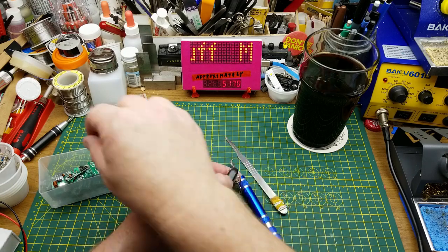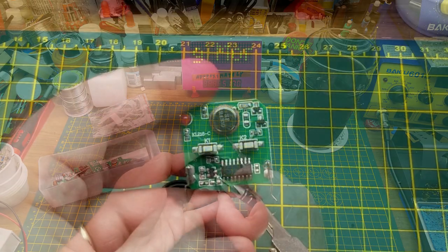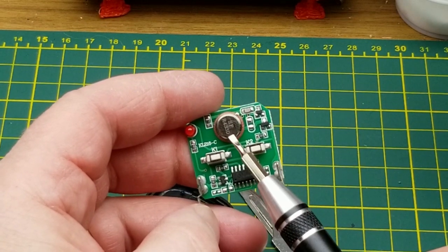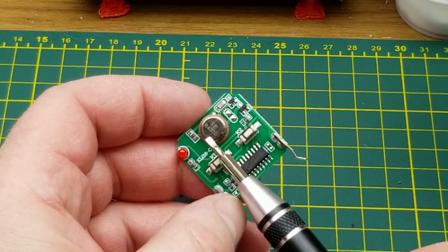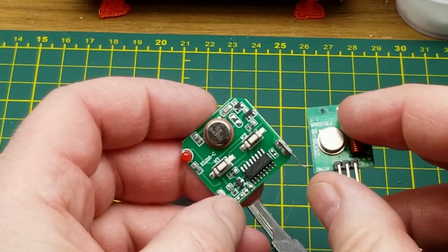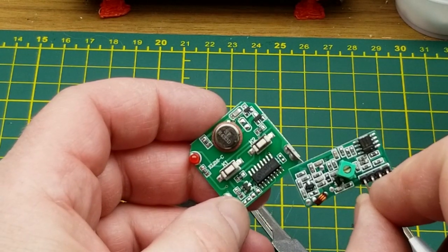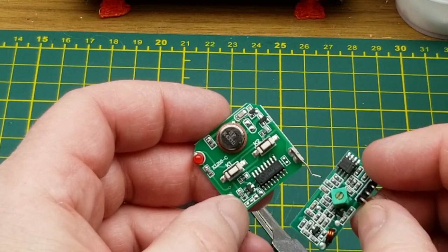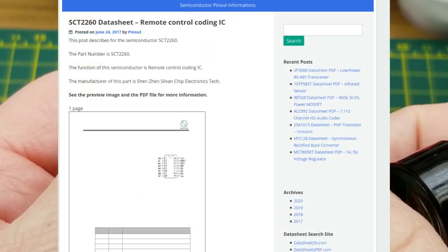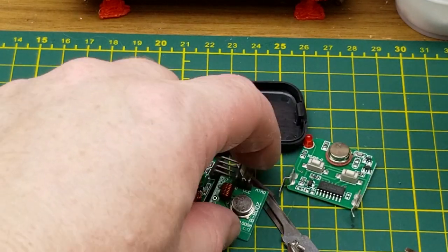The listing mentioned having to program it, which seems odd. Let me pop this open. Inside we have a little chip, a couple of push buttons, an LED, and that little RF R433D can — which is similar to the little can on these other units, a little three-pin device that also says R433. One has a slightly different chip — this one says SCT2260.